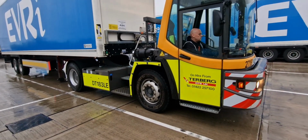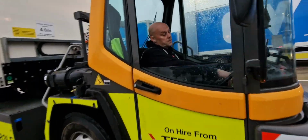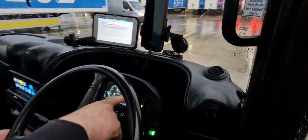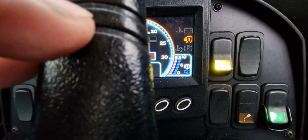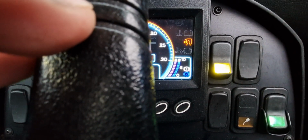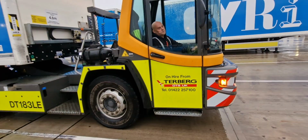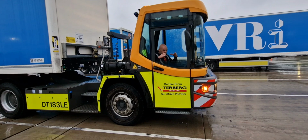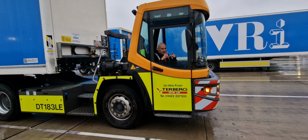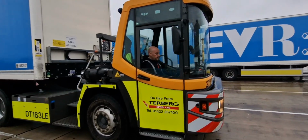I'm connected on the dashboard. I can see on the dashboard the fifth wheel locking mechanism. It's that little red icon. It shows me the fifth wheel is locked. I'm going to do the two tests, which is gently pulling forward 2 times, so I'm making sure I'm really connected. It's not a loose connection or something. Sounds good to me. Apply the park brake.